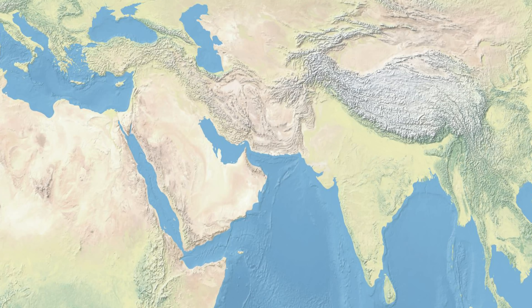Wootz was made in many different places throughout history, but in the context of the aforementioned ancient finds, the vast majority of wootz came from several key regions, which are described in ancient texts such as those by Al-Kindi, Biruni, Pliny the Elder, and others. These texts claim the iron was generally sourced from either Ceylon or Khorasan, and was then subjected to local variation. In particular, there were forges in Merv, Bukhara, South India, Hyderabad, and Isfahan. Different processes were used to create wootz in these regions, with different crucible materials, constructions, and varied crucible charges. Some mentions of unique Indian steel even date back to the 3rd century before the Common Era, in the form of white steel given to Alexander the Great by Indian rulers.